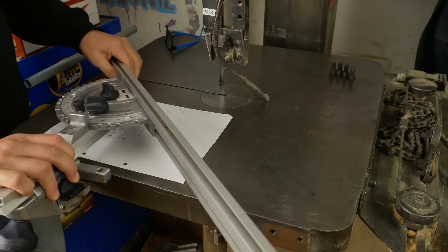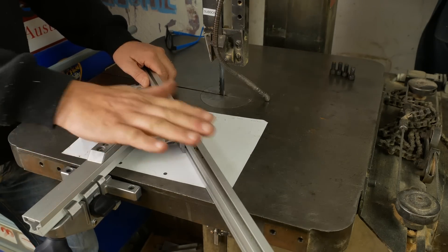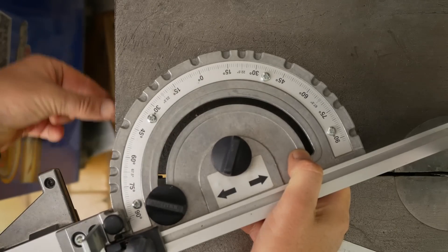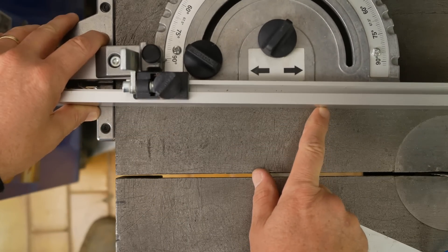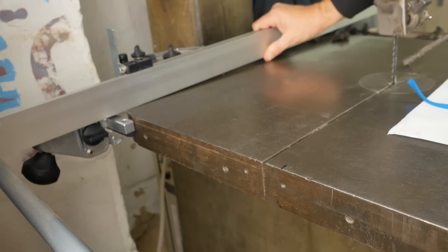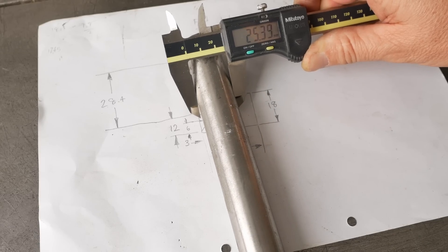The second thing I picked up in this design process is that this is really just a static clamp, not really designed for guiding. On the original Festool this clamps onto a whole sliding mechanism. Maybe it'll sort of work if I don't tighten it up too tight and just slide it, but really where it would shine is as a ripping fence. If I bolt a strip of this profile along this edge, I can easily mount this at 90 degrees and set whatever ripping distance I want. I'll make up a short length of profile, overhanging a little out the back so I can run it right up to the edge and still clamp it, and drill two extra holes to mount it. I've got a bar of one inch stainless steel so I'll use that.